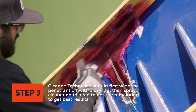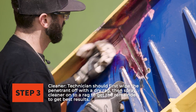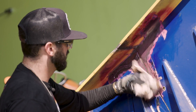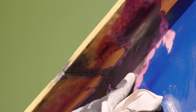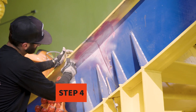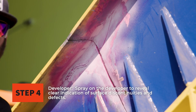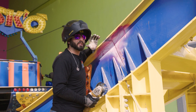Now we go clean off all the excess penetrant. Don't get this stuff on your clothes — it stains really bad. You'll see the guys who do this for a living covered head to toe in red. We don't even need to put the developer on — it's just bleeding up there already. That crack is clear as day. It's really hard to read a crack on a jagged weld, that's why we cleaned it up first. We've got a really clear line. It looks like we've got some other stuff on the back side we're going to have to repair too while we're here. No cracks — we want to leave no cracks.